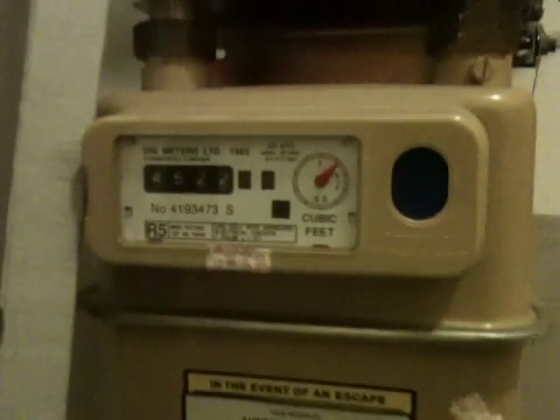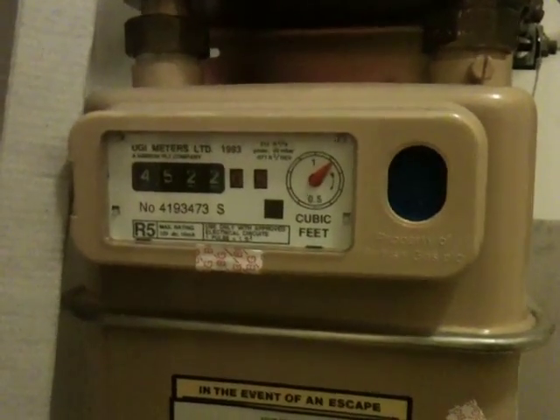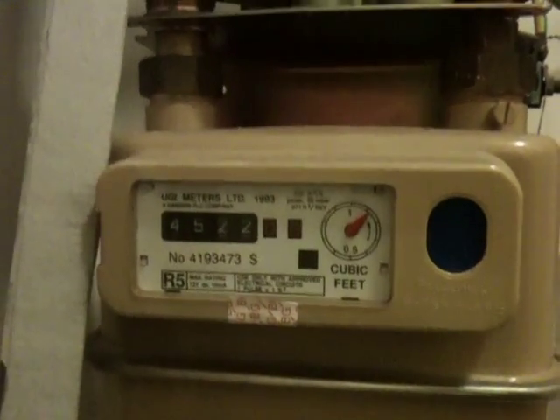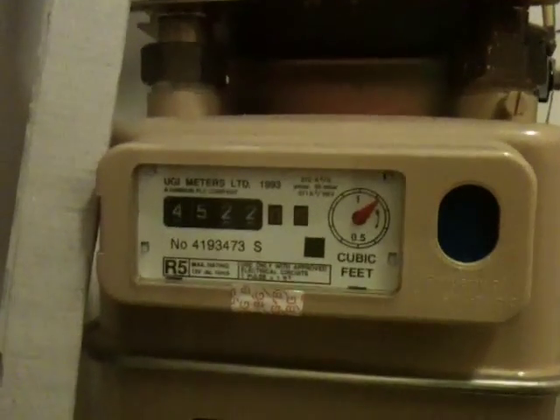The pilot timer switch is not sufficient to switch all those storage heaters, so there's a contactor to switch three phases' worth. And just a large gas meter there, marked in cubic feet, and it's not really doing much because this is really only used for cooking — I'm not sure it even heats water. I think the whole thing is heated by electricity.